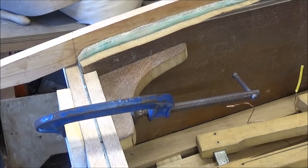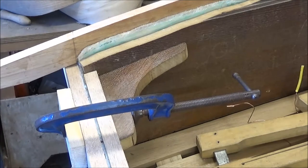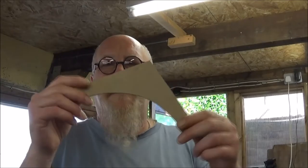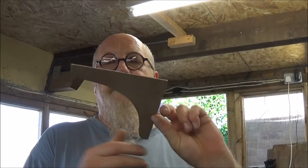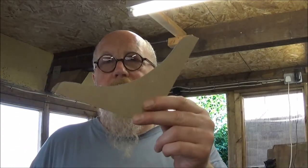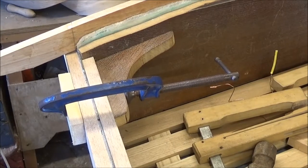After the last episode, where I finished bending the in and out wales, I've moved on to the next couple of jobs, one of which is making two of these. They're called quarter knees, and they are a support between the side and the transom. I've made up a template using a sliding bevel, taking an angle off the corner and then roughing out a curve, and marked out on a piece of the offcut from one of the seats and cut them out with a jigsaw and then planed and fitted them into the corners,